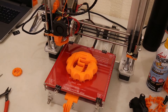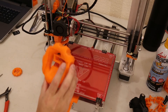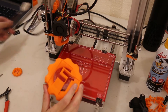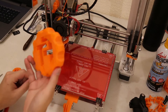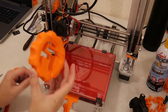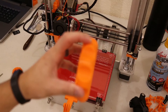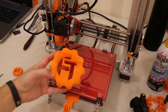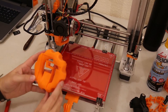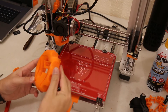Here it is, fresh off the plate. The printer is cooled down and what I love about using the glass is prints just come right off — no scraping, you don't need anything to pull it off, you just pick it right up. The print came out amazing. If you can see some of these layers on here, this just looks spectacular. This is also printed at a 0.1 layer height, which I probably should have changed but forgot to. Not a big deal — it's super smooth.